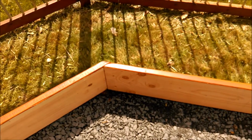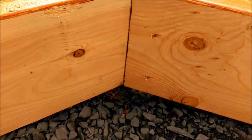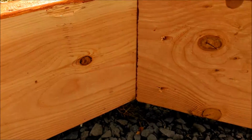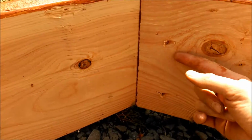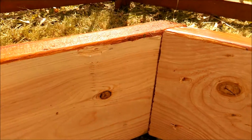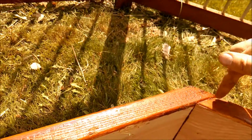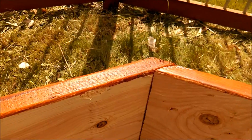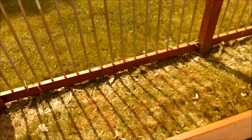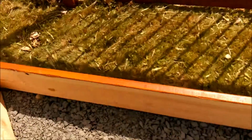If you have a rhombus like I do, and I can guarantee you you're probably not, but if you are, on the obtuse angles, you could even put some extra screws like this, just for a little strength, since really the screws you're putting in through here are always going into the end grain. Not the strongest joint. Can't do the same over here quite as easily.